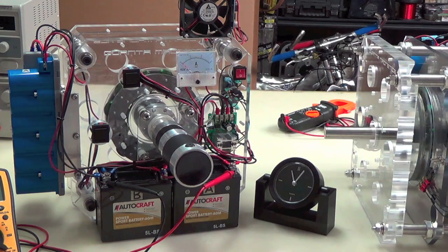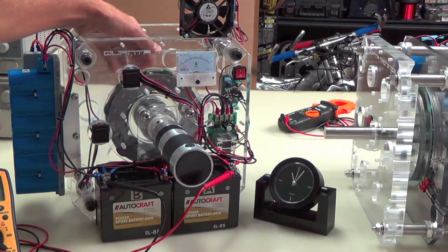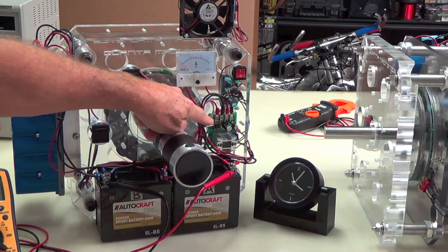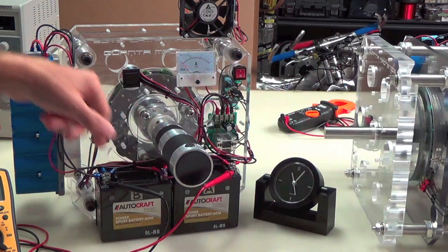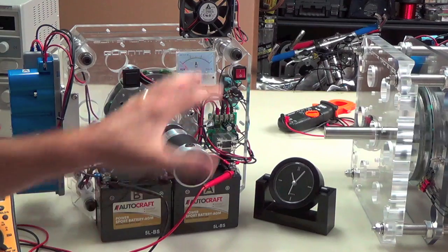So beginning, we've got this motor, and we've got the 3-phase, 2 AGM batteries here, 2 ultracapacitor modules here and here. There's 350 farads in each one of these 6 sections of each one of the modules. And I've got a pulse width modulator circuit, just a simple little circuit that keeps this within its range. It's a 12-volt DC motor. And I've got 3 bridge rectifiers that convert the AC off the 3-phase back into DC that feeds back into the system.